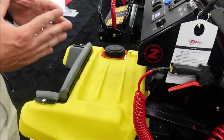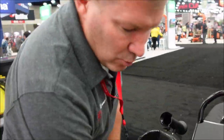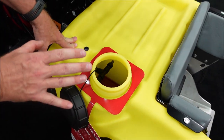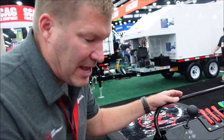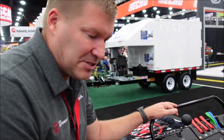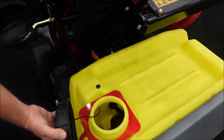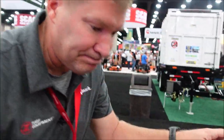Tell me about the spray tank — what size tank is it, what kind of spray system, and what volume are we talking about? We've got a 20-gallon tank, and in that tank we actually have two pumps. One pump is dedicated just for agitation so we can suspend wettable powders and keep the agitation up. This 20-gallon tank, the way it's set up from the factory, will do about a third of a gallon per thousand, so you'd get about 60,000 square feet out of that tank. You can also change tips and really get the machine to do whatever you want as far as liquid.